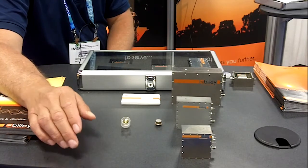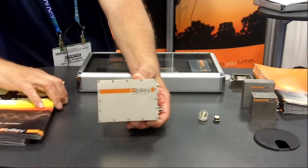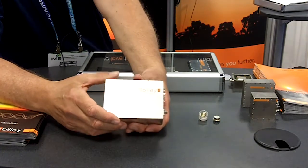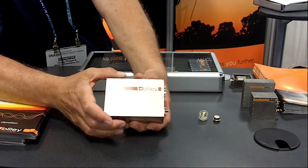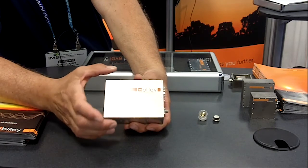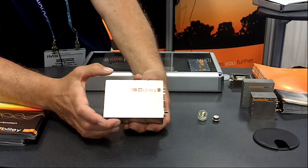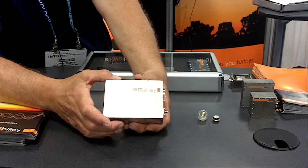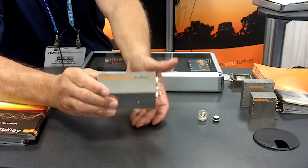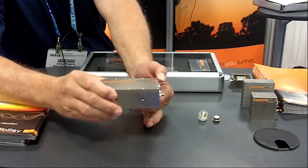These lower-sensitivity resonators will be selected for oscillators requiring lower G-sensitive processing. The next form of nullifying G-sensitivity is mounting the entire oscillator onto a platform. This platform is located in this housing — our Poseidon 1 product. It's a mass or plate mounted on springs, tuned using various weights of the plate as well as spring constants. Through that motion, we can offset some of the G-sensitivity of the quartz crystal in our final oscillator across all three axes.